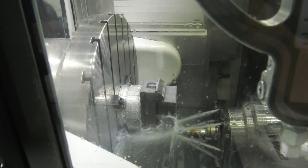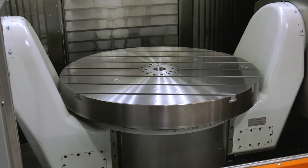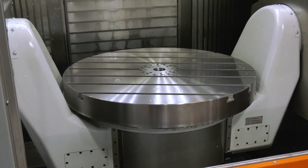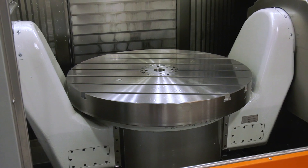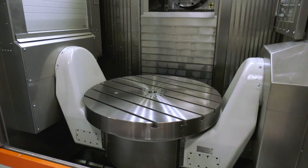Well, it is — this is a very heavy-duty machine. The spindle has just nigh on 40 kilowatt, and it's an HSK spindle, so it's built for power. Aerospace will be a breeze, but obviously tougher steels, Inconel, and so forth will easily go through the machine. So maybe I'm underestimating this machine in just saying aerospace. Tell us in your opinion some of the applications that are more difficult and heavy-duty that you would put on a machine like this — your typical mold and die component.